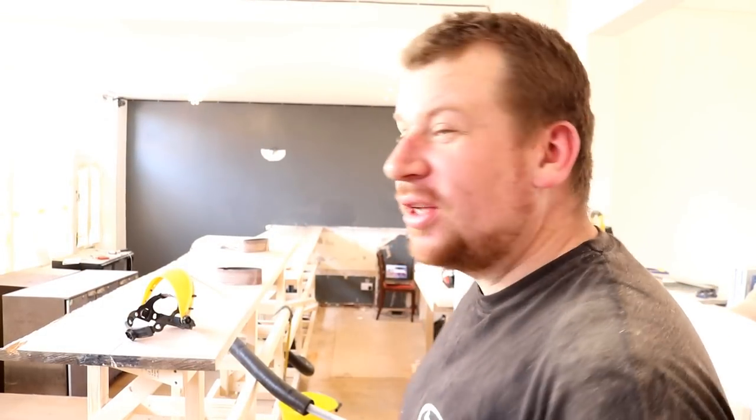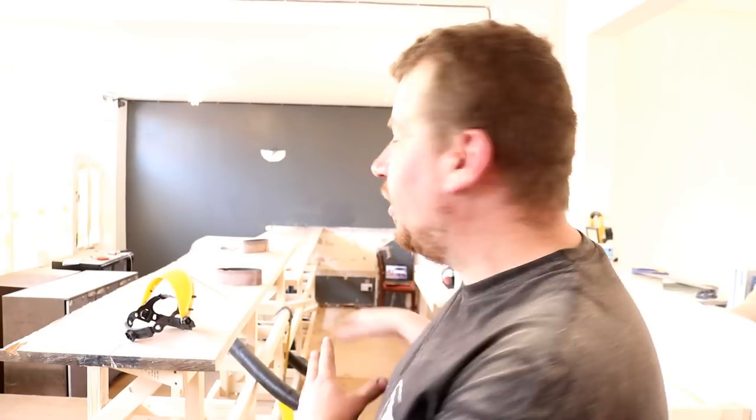Afternoon, folks. Welcome to the new brew shed, he says with an echo. So this morning, as well as chopping down some of the back bar, I've spent most of the day putting the Dutchmen into the bar to prevent any further cracking or splitting at the end of the timber, the shakes, for instance. So I think we've got most of them in place.